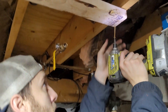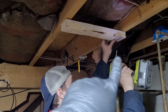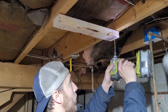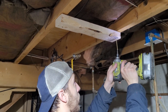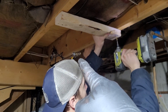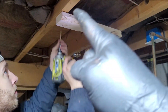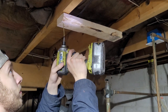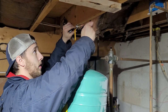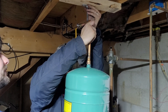You can hear but not see — there we go. So we're putting this wood, a two by four, up top so that we can strap our expansion tank to it, just to take some weight off. We already soldered in that ball valve, so that's just for extra support. We're going to strap it — you'll see the finished product. We're going to toss that in, solder it, and hold it up with that. That's the hope at least.